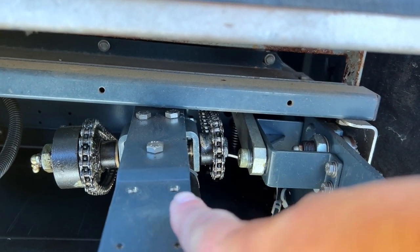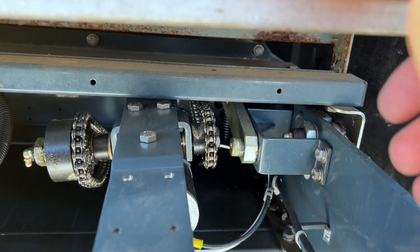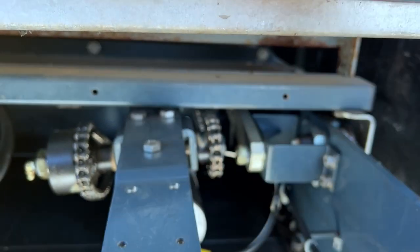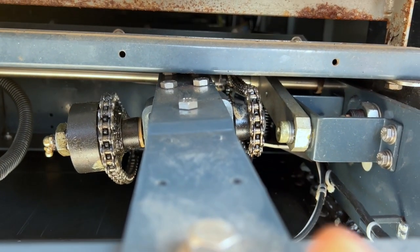This is our drive chain assembly here, and that's a clutch mechanism. But this is responsible for pulling this whole lift carriage in and out. And when it bangs against the end stops, which is how this model was designed, it puts a lot of load on that before the clutch releases. And we wind up getting this bracket here twisting a little bit.